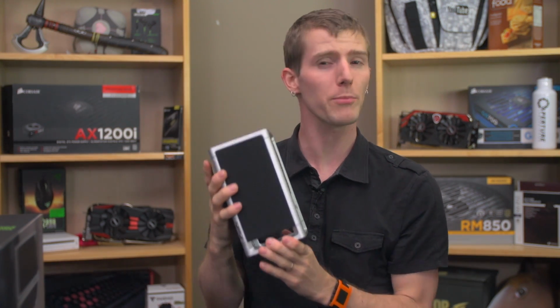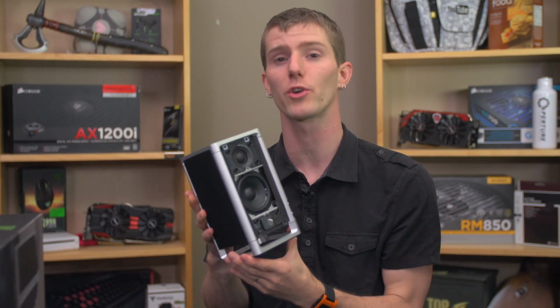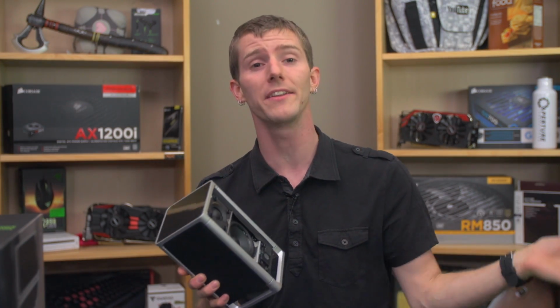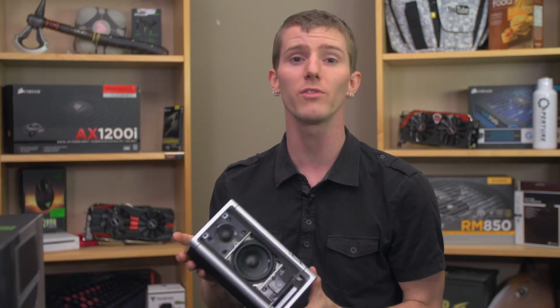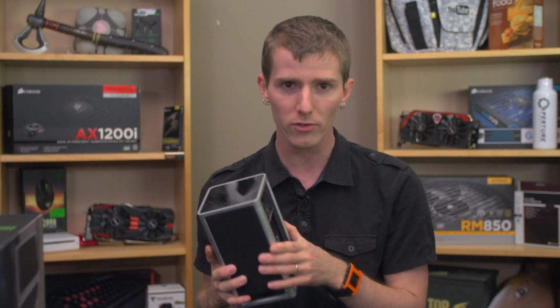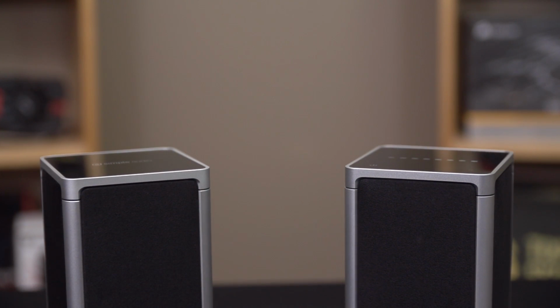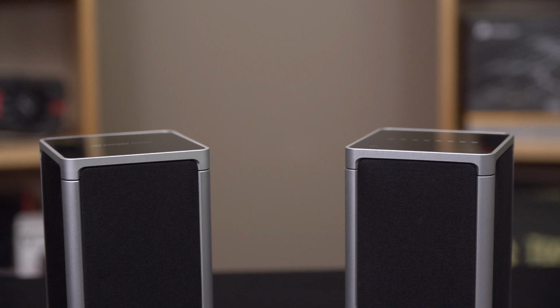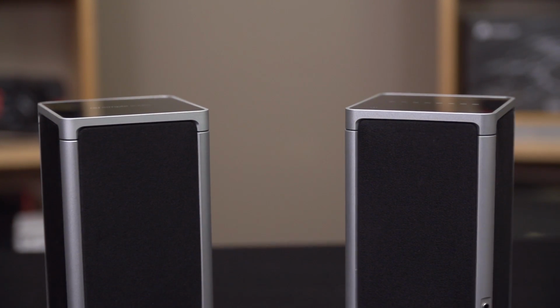The benefit of separate amps to drive each of the main speakers is that it provides plenty of headroom to reproduce sound correctly at both low volume and at peak output and everywhere in between. Separate amps also enable the system to use its finely tuned DSP-based active crossovers to improve dynamic range, reduce distortion, and generally give the system better control over each driver. This is a great feature. Active crossovers are just plain better, and the main reason less expensive systems use a passive crossover is simply to save on the cost.